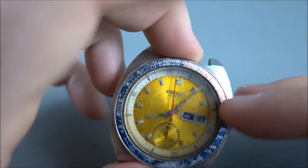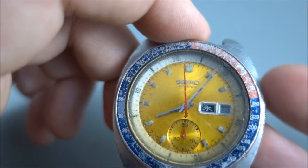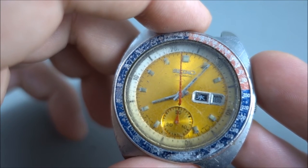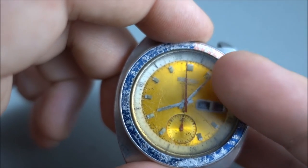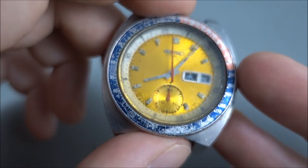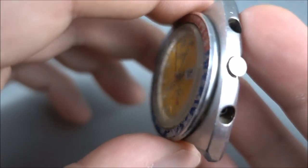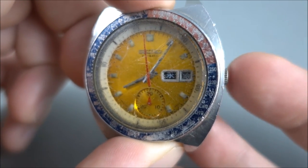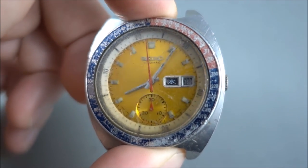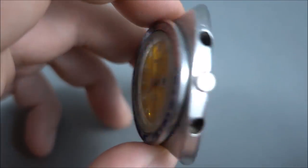In summary, with these watches: I wouldn't buy it if the ring is drastically off colour — the rings are unavailable, and to get another one you're probably going to have to scrap another watch. If the case is bad, that can be replaced easy enough. If the dial's bad with lots of marks on it, don't buy it — the dials are impossible to get and the reproduction dials look terrible. A bit of a black ring around the sub-dial is okay. If the crown is wrong, probably don't buy it. Currently the stems are available and I manufacture the gears and springs that go in there at a pretty good price. But if the stems ever became less available, I'd definitely steer well clear of it.